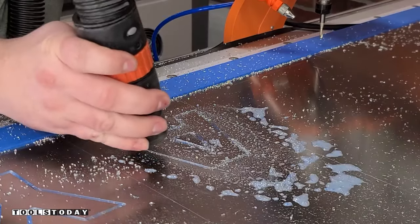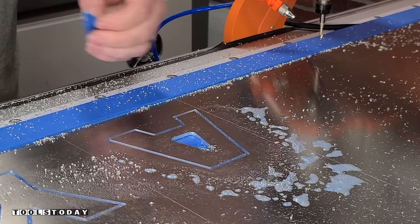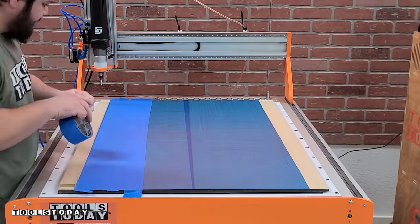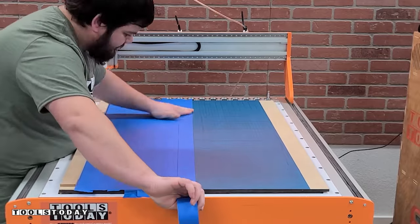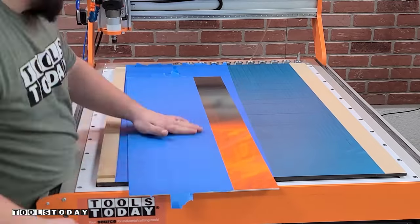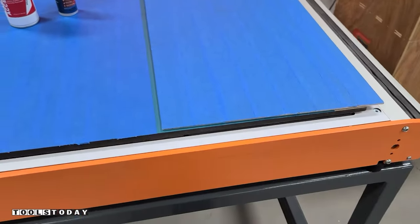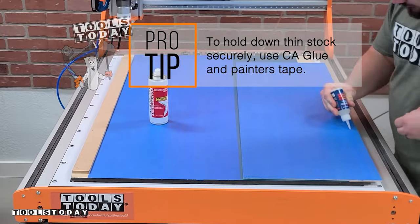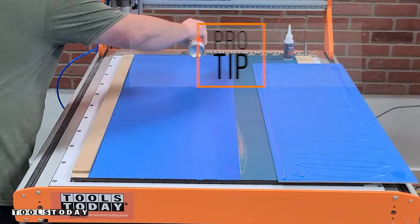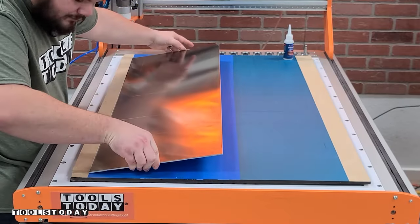We're going through in four passes to get through all of the aluminum. Essentially that's because I'm using the blue tape method — painter's tape on both sides of the material. I have Oramask set down on the wasteboard of the M1000 so I don't get any misting fluid on the MDF. Then I'll use Starbond adhesives CA glue with some accelerator to attach my material.